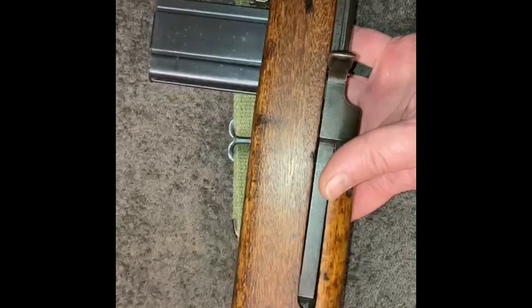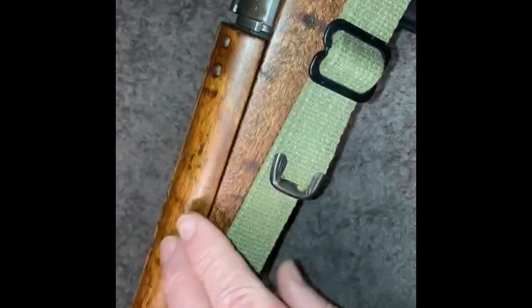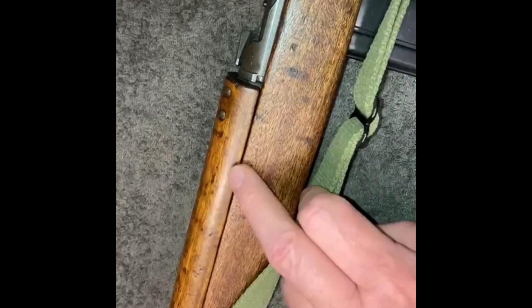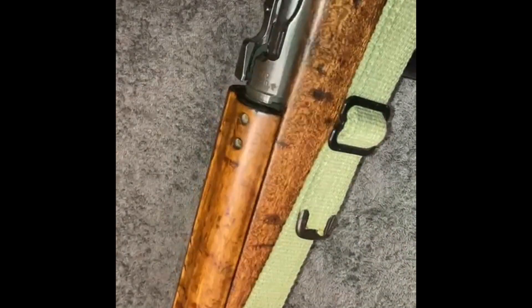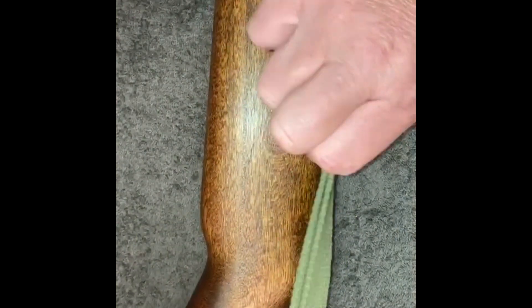I really just worked on the wood. I cleaned off all the peeling varnish, gave it a light sand, and gave it an oil finish and it came out okay. I put a walnut stain onto both pieces — I tried to get that one slightly darker and this one slightly less red, and it kind of matches better. You can see it's two different types of wood.